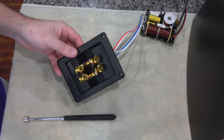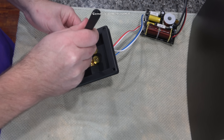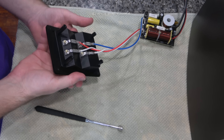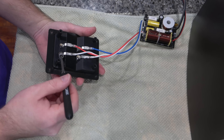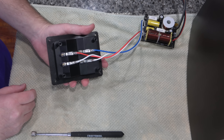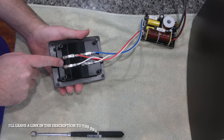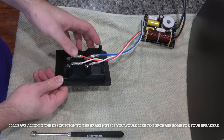I'm going to look at the terminal cup to see if they're using any ferromagnetic parts. The binding posts are not magnetic — that's great. The nuts that hold the binding posts on are made from steel, as are the clips or terminals that the speaker cables plug into. These could be easily rectified — you can buy some brass nuts to replace them and also purchase new terminals for where the speaker wires connect.